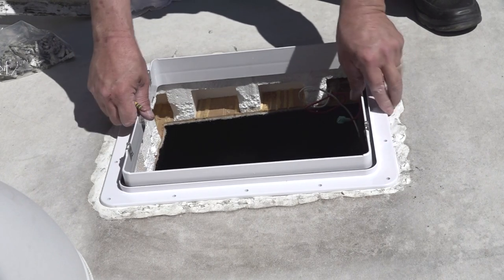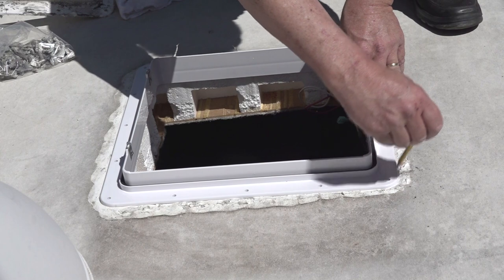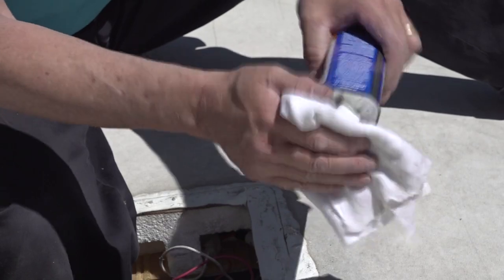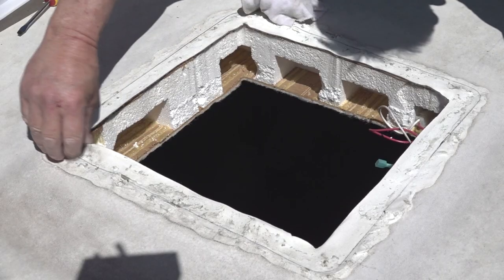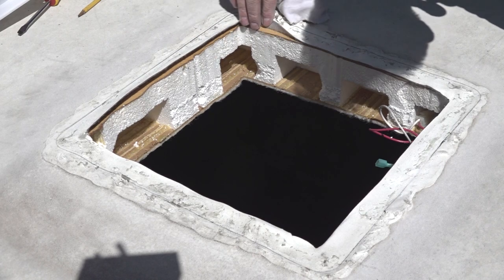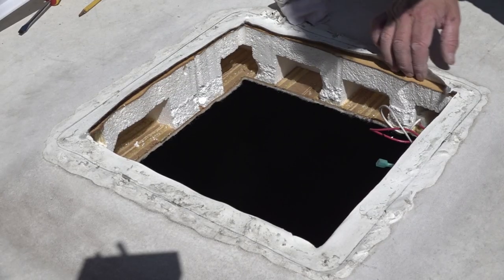You can place the new vent in the roof opening and trace around it using a pencil to make sure the area around the vent that will be sealed is clean and free of debris and old sealant. I used some denatured alcohol on a clean cloth to clean the roof surface. Use this opportunity to examine the framing and roofing material around the opening. What you are looking for is anywhere water intrusion may have started or where the potential for leaks might exist.